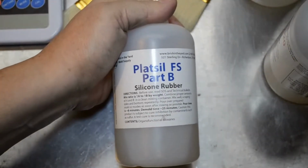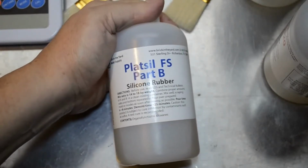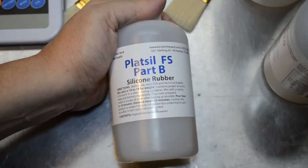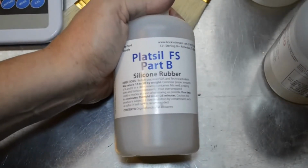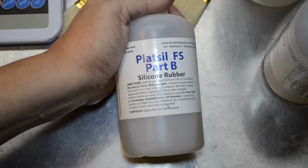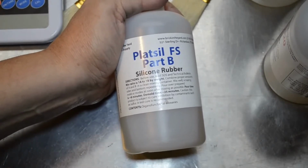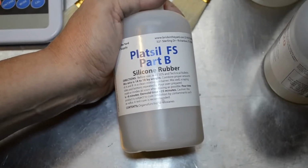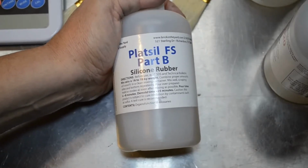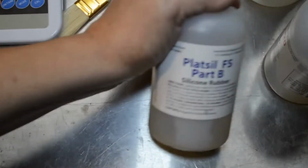Using any platinum cure silicone, even tin cure silicone, one must be aware that there are things that can inhibit the curing of the silicones, most especially platinum. They're very, very sensitive atmospheric cure silicones. The big thing you need to be aware of using any platinum based silicone is to use a sulfur free clay as your mold wall, or in building up anything about the subject to be molded, or even the subject itself should be sculpted in a sulfur free clay. With that said,